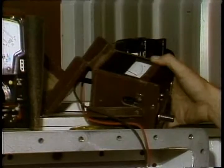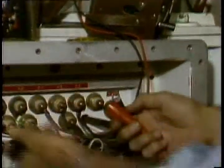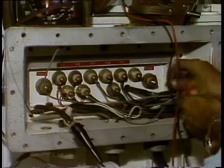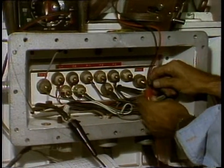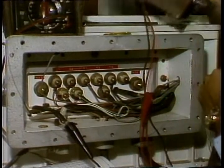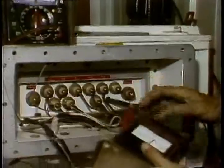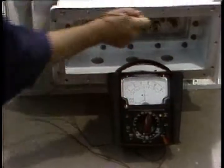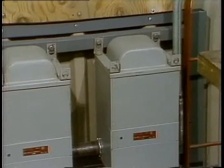You can use a megger to test a cable for continuity or shorts. Be sure to disconnect all leads from a subassembly at the SCR box before megging that subassembly's cables. The megger's 500 volts can damage some components. After checking cables, perform the routine resistance checks. There are some other potential trouble areas, and here are some tests for these.